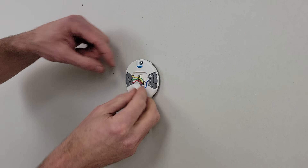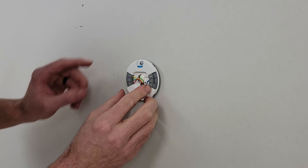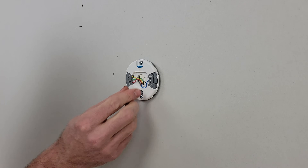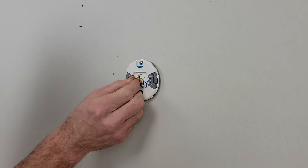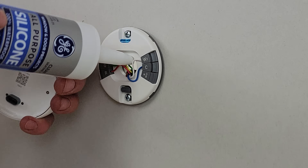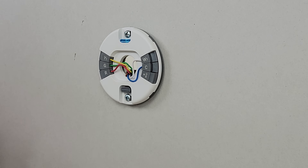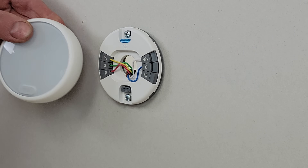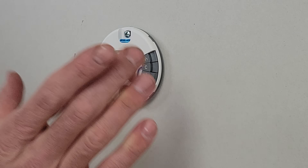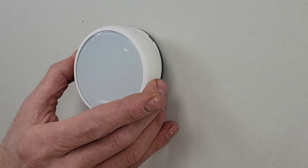Make sure these wires are not tensioned against each other in such a way that if part of the jacket is worn they won't touch each other or vibrate over time. Make sure there's nothing blocking the wire connections. You could add some silicone — which is non-conductive — back here to seal up the hole so that low or high temperature air doesn't come into the back of the thermostat and mess up the temperature reading. In this case we've already sealed the top or bottom hole with fire sealant, so it really shouldn't be a big deal on an interior wall. Then we just install the thermostat face and we're good to go.